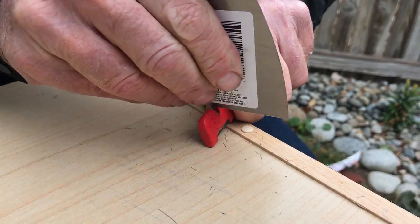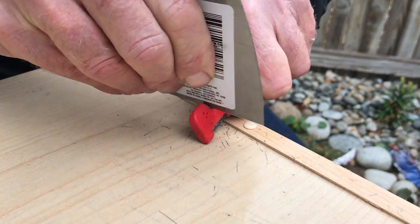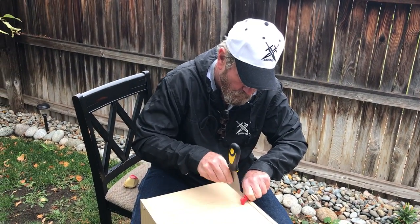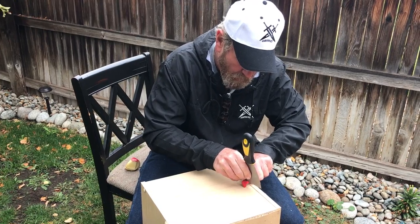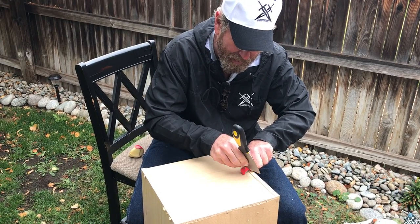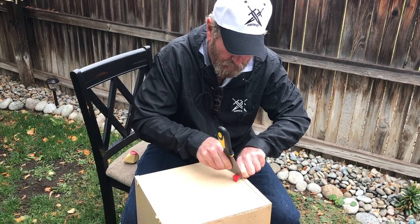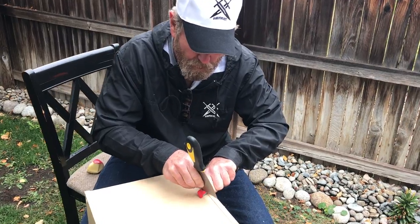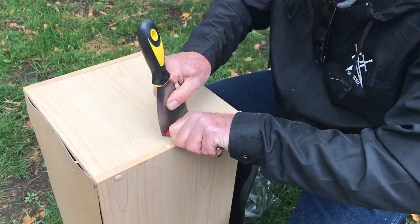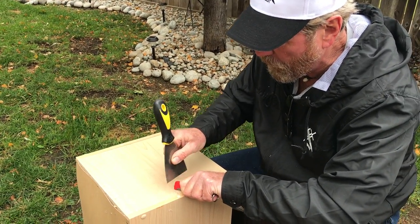Now I'm going to turn it around and go this way, see if I can keep it symmetrical. You do have to be careful — if you get it right on top of the carbide on the corner, it also takes the cutting edge off. That's why I have to be careful to make sure it's down in the V, in the V notch, so I'm not actually going backwards on my sharpening. You can hear the difference when I don't get it down in the V.